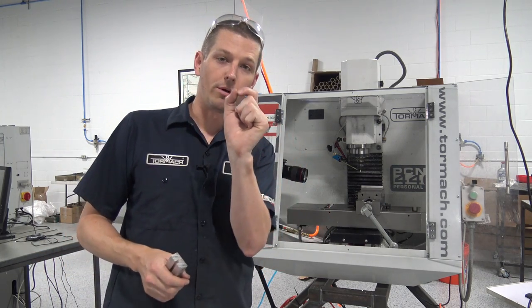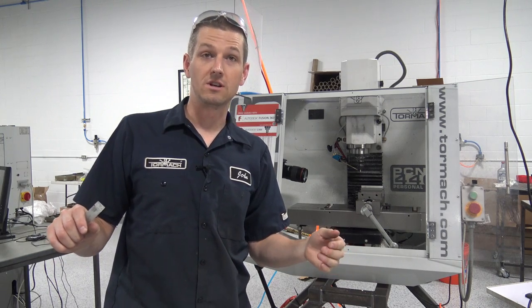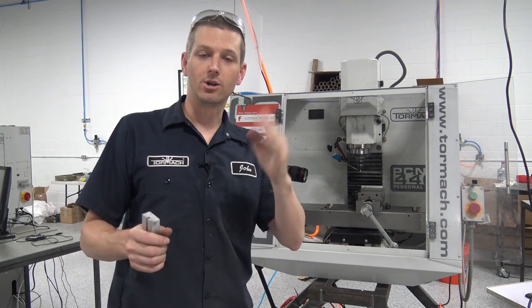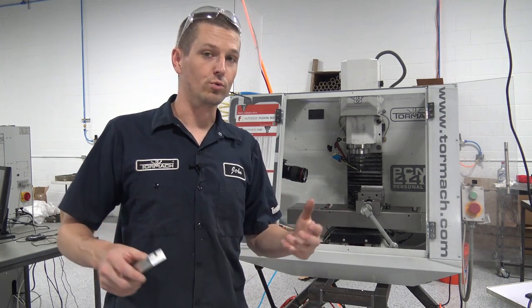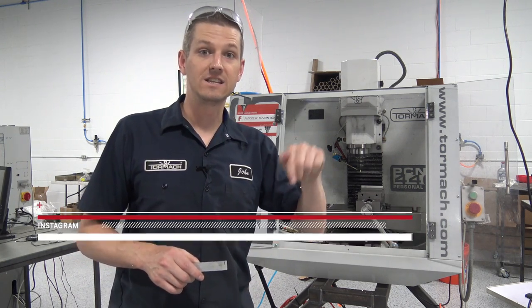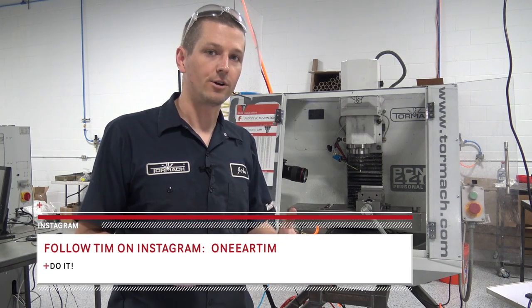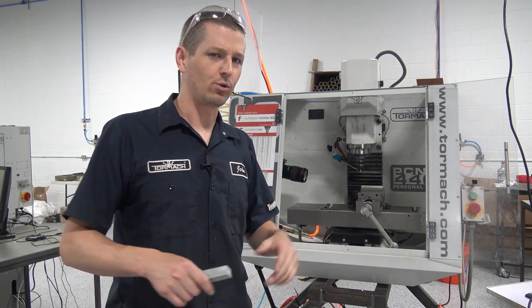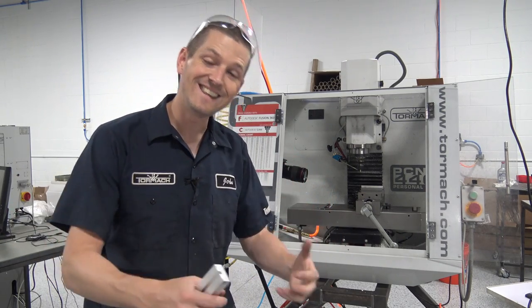Today we're gonna machine a 0.4 inch wide slot, and I would have always used probably a quarter inch, maybe a 3/8 inch end mill, giving me a little bit of wiggle room. But Tim Paul, who's one of the CAM gurus, and a really good guy and a really smart guy, you should follow him at least on Instagram, was texting me and said, hey, Saunders, try out a pretty crazy, to me, like totally crazy chipload on this tool, a 3/16 tool.